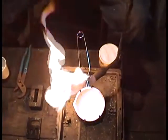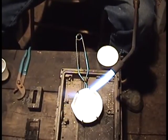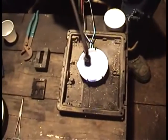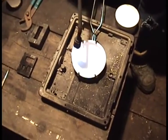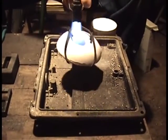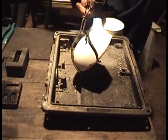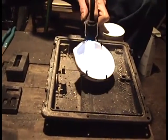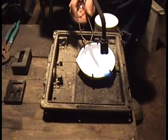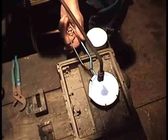There's a little bit of oxygen and you just want a little heat coming out of there, and then we just want to play it around on the surface of the dish. Now one of the problems that a lot of people have is they put too much glazing on this dish and it will tend to make your gold or your silver get stuck up in that flux. All you need is a light coating on this dish.